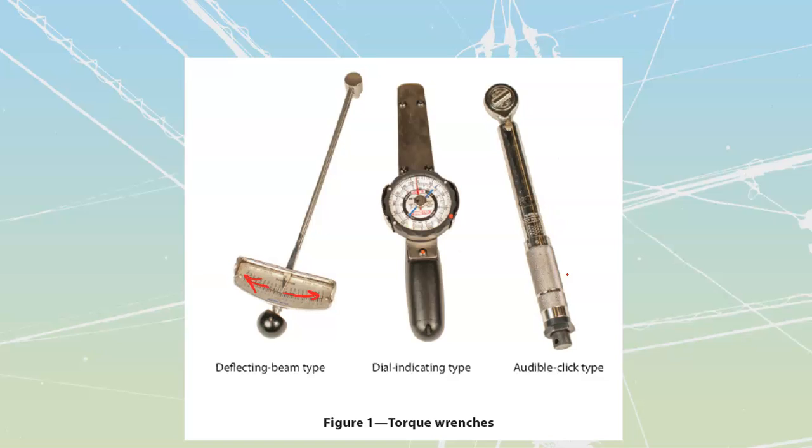It's kind of similar to the chuck that you have on almost all cordless drills, where you can adjust it. It's like a slip one, and once it reaches a certain amount of torque, it then drops out. Follow the equipment manufacturer's specifications. If you don't know what they are, you've got the piece of equipment in front of you, just look up the part number off of it, and you should have those pretty much instantly. There's so much information available to you at this point, through the wonders of the internet, that it just does not make sense not to have looked it up first.